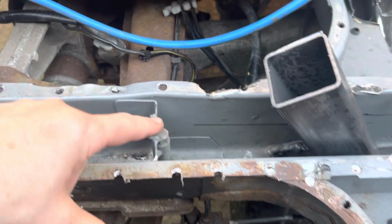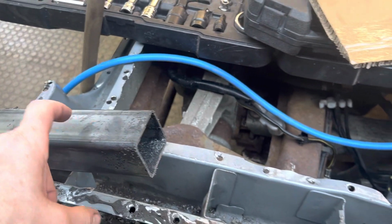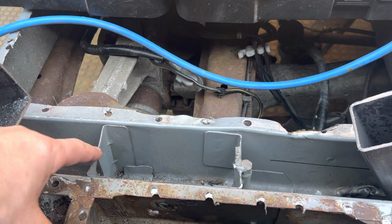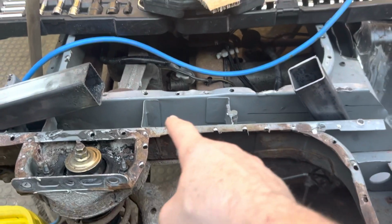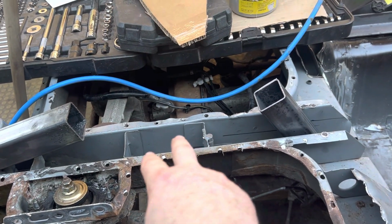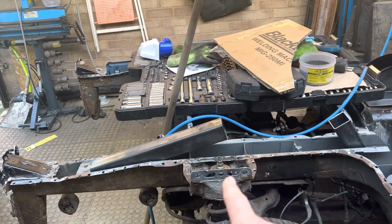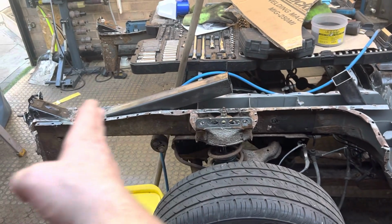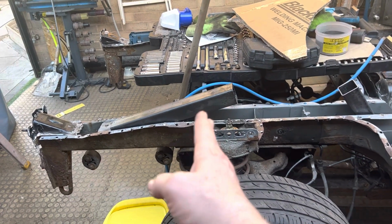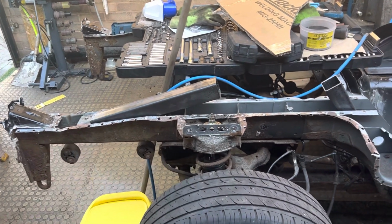I'm going to cut that framework around there for the subframe mounting. Drill a hole in there to weld that to, and then I'm going to finish it up by welding it against that panel. So essentially two of the subframe mounting points and the chassis leg will all be tied in, and then for any potential problems in the future, we've still got from there, which is halfway across the wheel backwards, as some form of crumple zone for both obviously the Escort and the Mazda chassis combined.